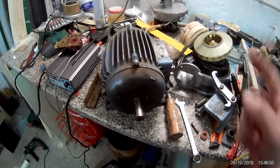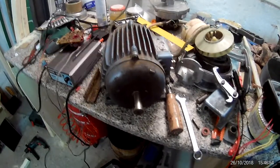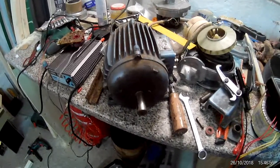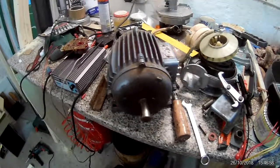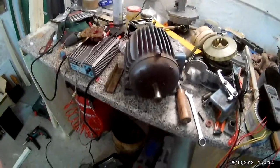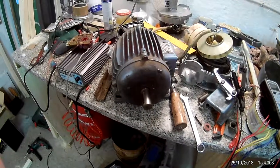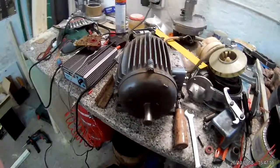We have yet another one that is actually a three-phase motor and I do not have three-phase power. So I have to either get a VFD or build one — I actually have two parts to build one. But that's a project for the future, or I'm going to rewire it for single-phase. Let's see if I can rewire it for single-phase for the time being.